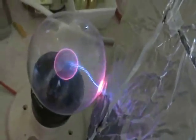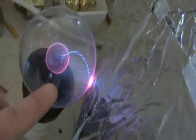And if I actually have it touch, it arcs at a certain oscillation — kind of slow. And now we are going up into the 60 volt range, which is pretty high. Actually my caps are 50 volts, so I'm going to back off on that.